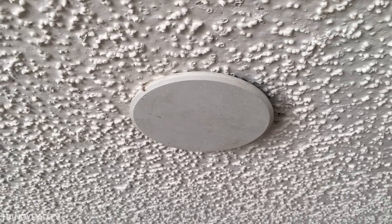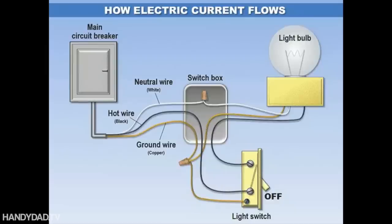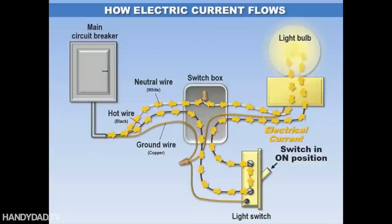If you have a rental and never did anything with home electrical wiring, let's go through a few basics. In the US the standard has three wires: black is hot, white is neutral, and bare copper is ground. Think of electricity flowing like water. When the switch is on, the power comes down the black wire to the light and then goes back through the white wire. If the black or white wire becomes disconnected, no electricity will flow through the circuit. The ground is a safety net that helps prevent you from getting shocked.